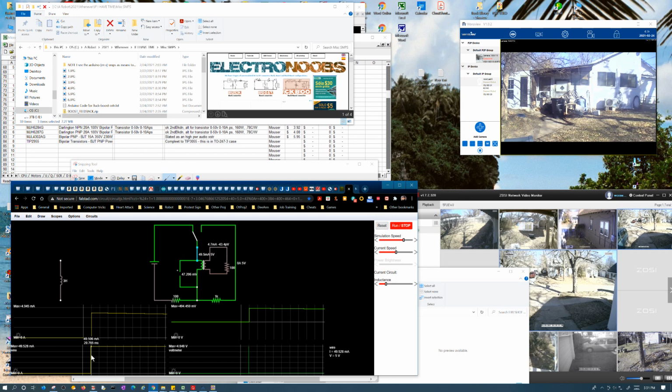But it's probably not 10 times that because its di/dt is not very high, I guess. But that's what's fascinating: this thing is behaving not like an inductor anymore, it's behaving like a resistor. Whereas before, we saw it behave like a resistor at first, but then like an inductor the rest of the time. But here, when we're dealing with the same impedances but a different turns ratio, it's like it's behaving like a resistor almost the whole time. So, that's very interesting.